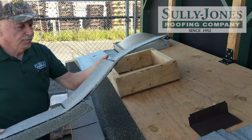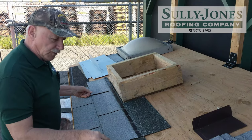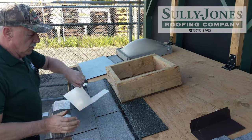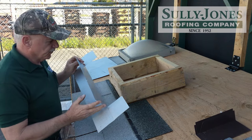To get up to the curb, you'll cut your shingle to fit around the curb and it'll fit your pattern. Then you will install a head flashing just like this.